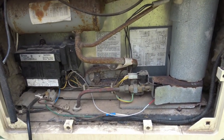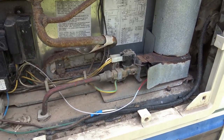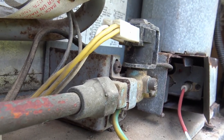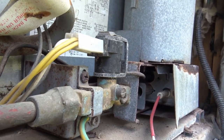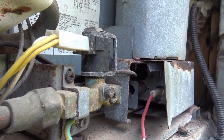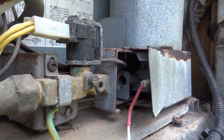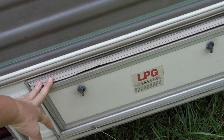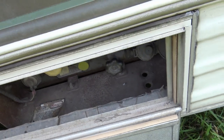So I started poking around in here trying to figure out what the problem might be. In there, I was able to see the blue and a little bit of orange of the pilot. All the reading and videos I saw said it should be a really clean blue flame. Even though I had taken it in and had it serviced and the flue was cleaned, I felt that maybe I should try to clean it myself. First thing, of course, is to turn off the gas. It's off.